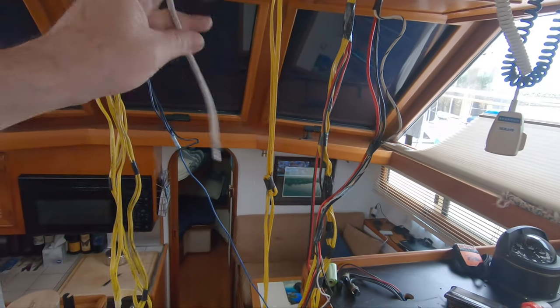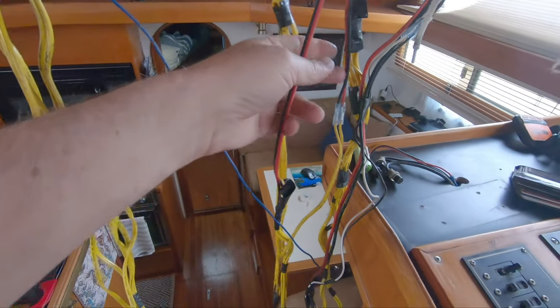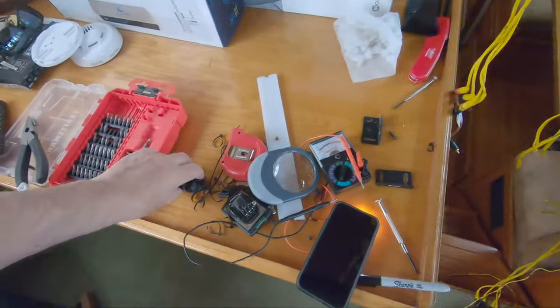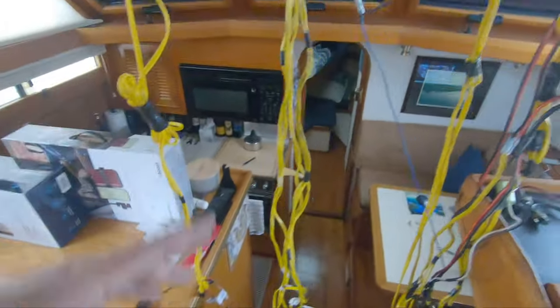There's an old-fashioned antenna here, probably just a radio input for the FM antenna — yes, that's what it is. I'll have to see where that goes out to the radar arch. Some of my cabling also changes from this yellow stuff and gets spliced into red and black. The guy used a roll and a half of electrician's tape, which after years just gets gooey and sticky and messy. I might just rewire everything with clean wire.